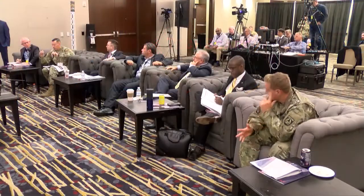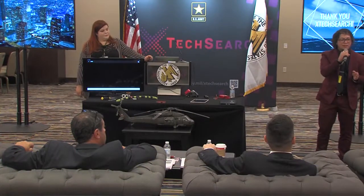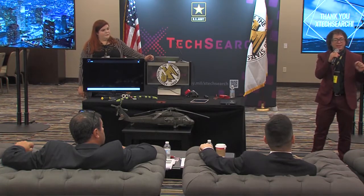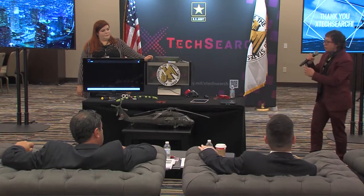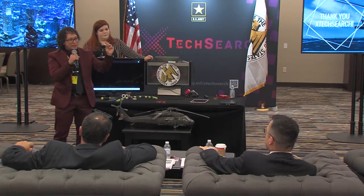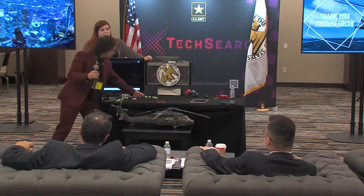I see how this would be beneficial in a new aircraft, but how long would it take to reclamp an existing aircraft? And how many clamps per wire bundle? There are wire standards — every six inches you may have a clamp, all the way to two feet, depending on the size of the aircraft. They're very easy to retrofit because we use the same number 10 hole that exists in the aircraft. You take out the old clamp and replace it with ours. Ours has a tiny bracket that uses an aluminum military standard rivet as a permanent structure, so you only ever replace the clamp — no alterations whatsoever.